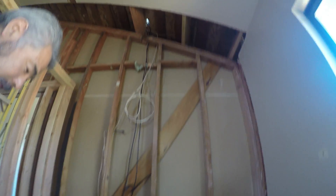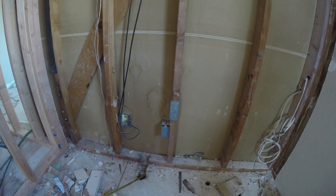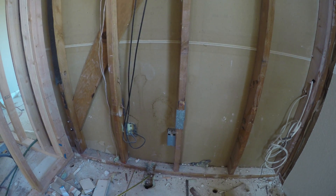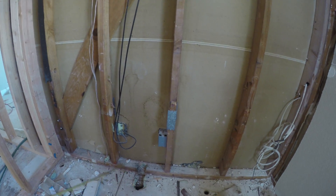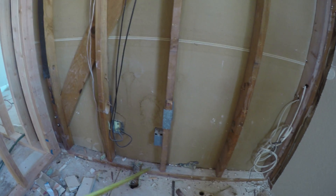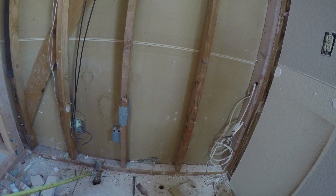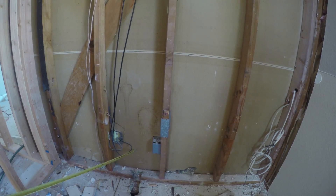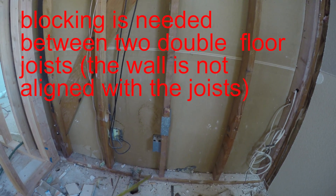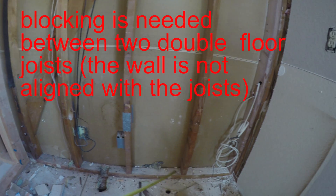On the bottom there's another issue. From this old hole we found out these are double joists here. The floor joists are doubled — the reason to double is to carry this shear. But before we opened this plywood to check the plumbing and electrical, we realized there's no blocking in between this double joist and the other joists on the other side. No blocking at all — which means all the nails on the old wall just nailed down the plywood. This is horrible.